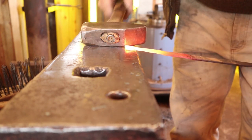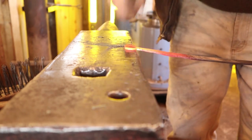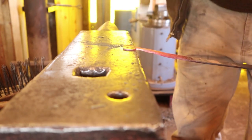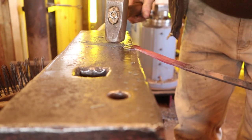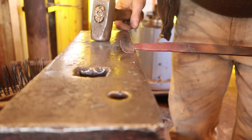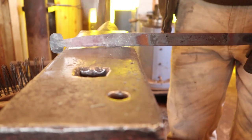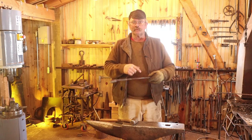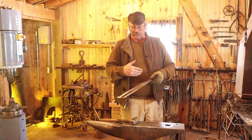The finial starts with the good side down, half-face blows, cross peen to one side, cross peen to the other, then refine it with the face of the hammer. Just don't mess up the little shoulder you've created — you can knock the corners off if it extends too far. This will all get filed to even it up. So now we're going to let these cool. I've done two straps the same way, so I have two short straps on one end and two longer straps on the other end of the pair of bars.